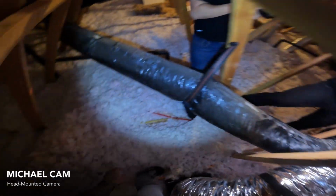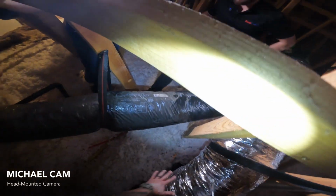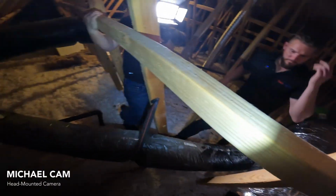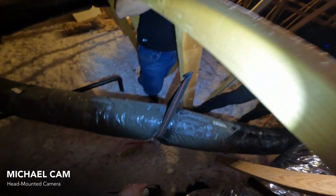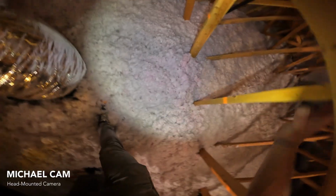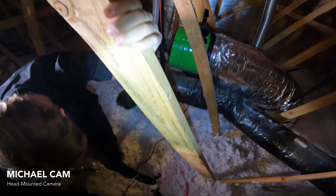Okay, anything else for installation on this fan on the attic side? In this location, with all the insulation that we had kicked around and moved around back here, as I'm leaving, I'll just kick the insulation back around the damper box over any blank areas that we had moved out, just so when we leave, there's no different cold spots, hot spots in the attic. Redistribute the insulation? Exactly. Okay, and you want to redistribute it around our damper box? Yep. Okay. Now we're good. We're just going to drag the power cord out with us and on to the next one.